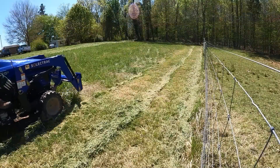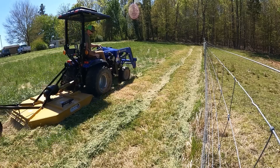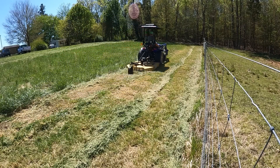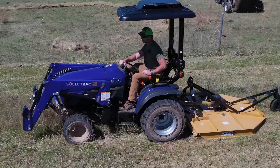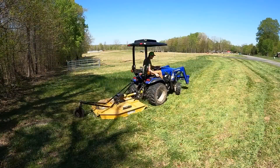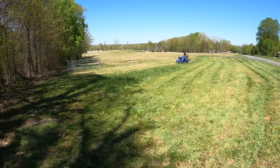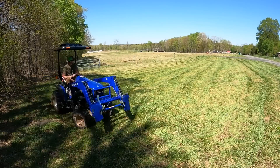I can't say enough about the simplicity of this tractor and never having to worry about running out of fuel. When the battery gets to a certain low point, it goes into limp mode and will no longer run the PTO — it will allow you enough power to get back home. From zero charge to 100% takes around 12 hours, so you plug it in overnight and you'll be using it again. It's really simple, really easy, and something that's easy to maintain.